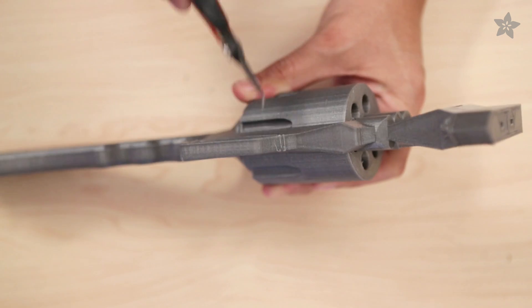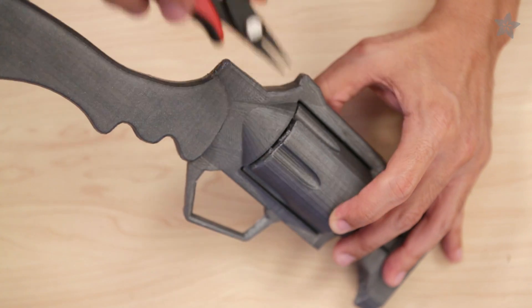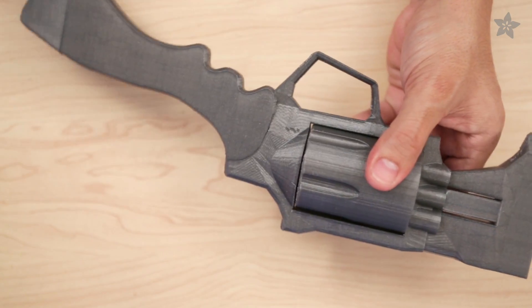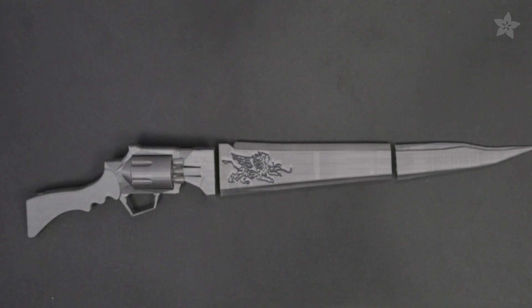Go ahead and clean up the remaining parts using flat pliers and remove the leftover support material. The cylinder is printed in one piece and is held up by a small amount of support material. Insert a small flat spatula into the cylinder and gently rotate until it can freely spin. Once all four pieces are clean, lay them out on a long table to assemble.